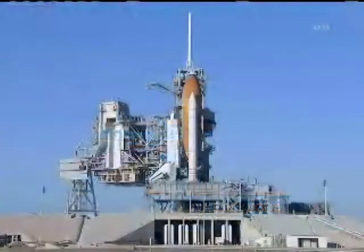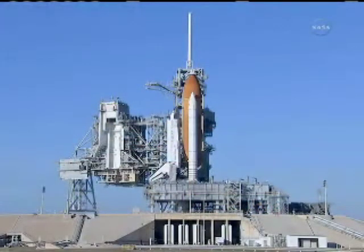And so we went through painstaking efforts to select a QD and to install it a certain way so that we could actually move what we call the concentricity in the direction of goodness, away from the relative motion that the vent arm puts into the system. And when you're talking about a proper alignment, this is really, really proper alignment. Yeah, this is space flight business.